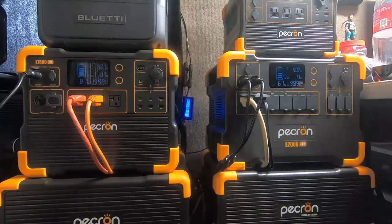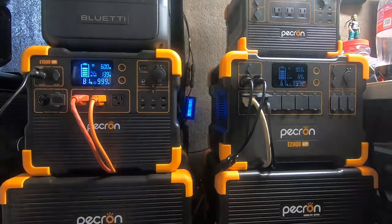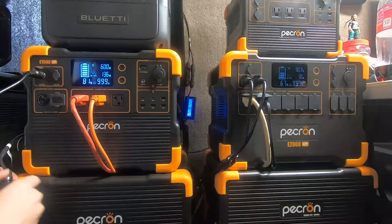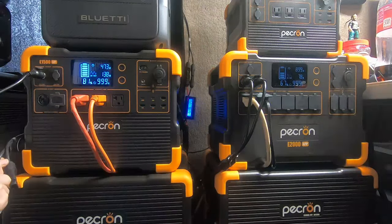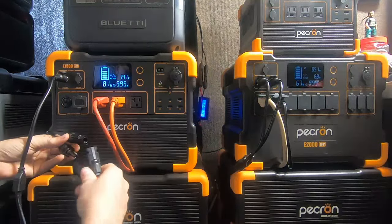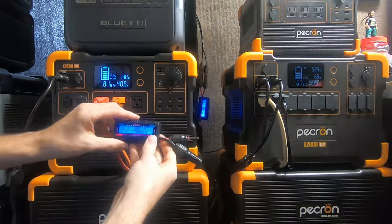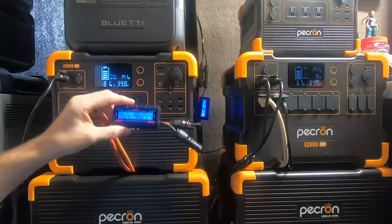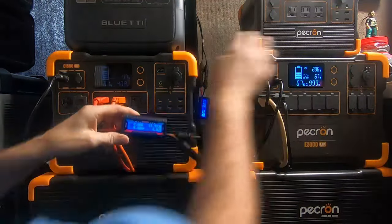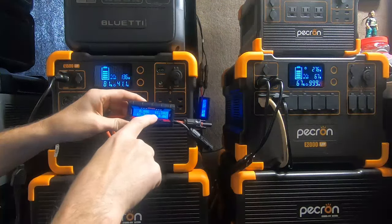Okay, I grabbed a watt meter. Look — 600 watts again. So I'm going to pop these connections now. Remember when you unplug things on the fly, just be aware it's not the safest thing to do. This is coming from the six Harbor Freight panels — no trickery. Notice it says the panels are coming in at 18 volts, but with three panels in series these two strings in parallel, look what they're actually coming in at: 61 and a half volts, up to 63 volts a second ago. That's the open circuit voltage.